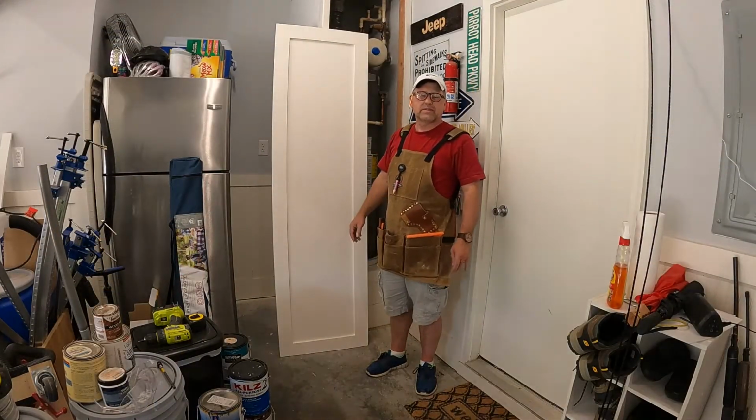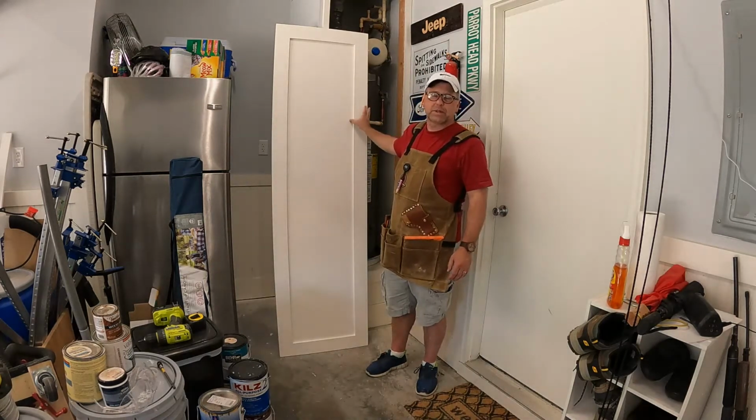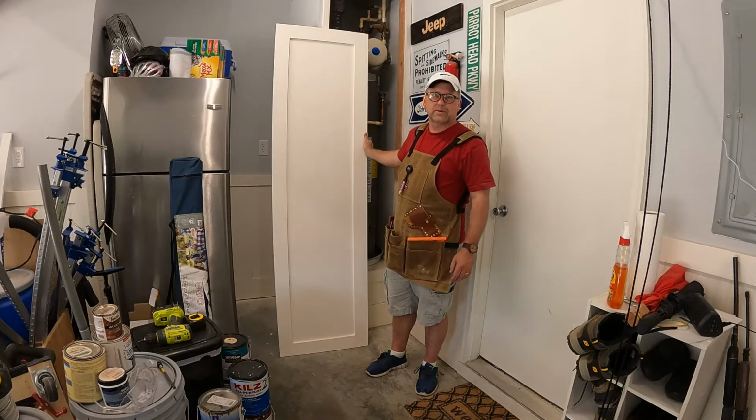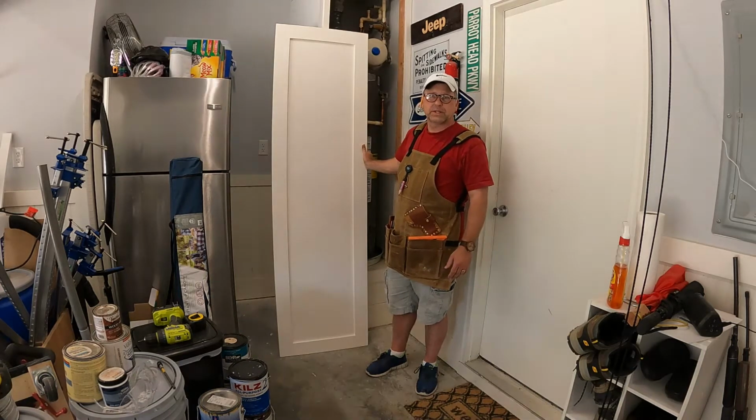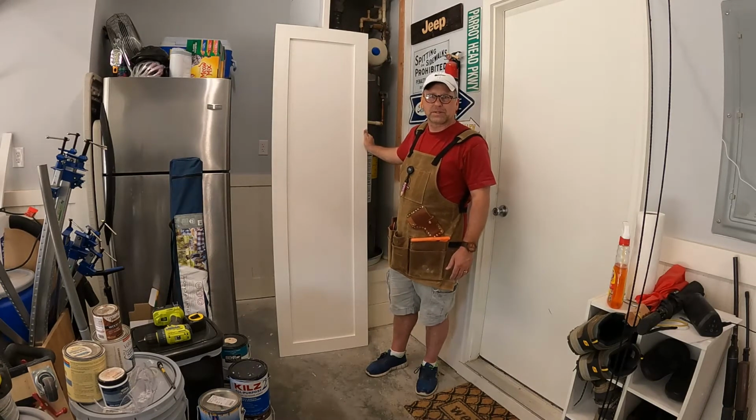Got the paint on it. All I have left now is to install the hinges and get it hung in the hole. Just using standard big box store 1/4 inch overlay hinges. Self-closing, should go together fairly easy. I allowed for a 1/2 inch overlap on all 4 sides. It's good enough for shop furniture.